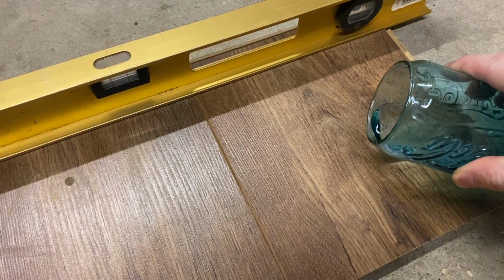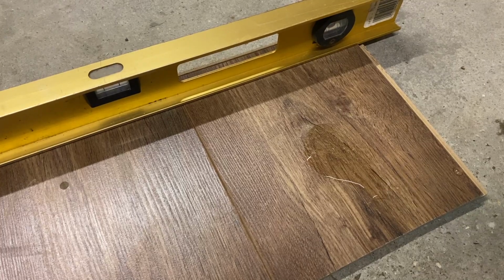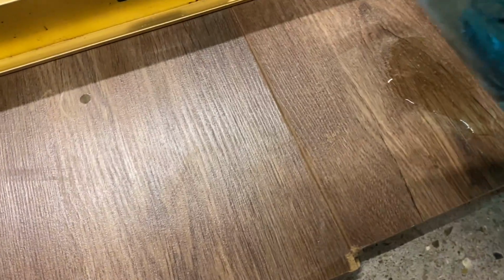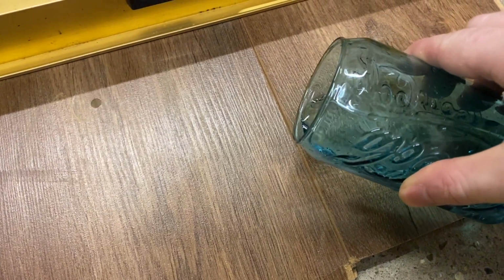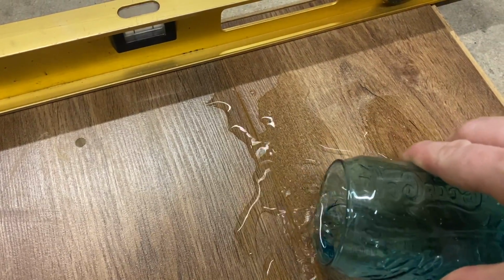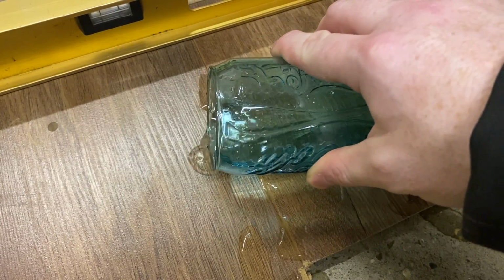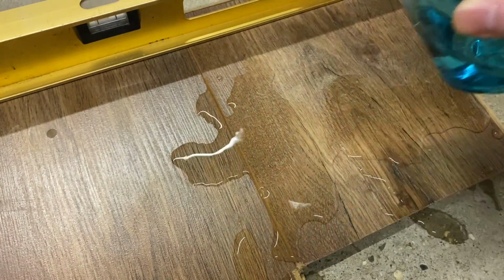And yes, you might well be thinking, and you are completely correct, obviously, if you spill water on the central part of the board, there isn't a problem. The water doesn't ingress into the board through the top of the board. It's at the edges. So I'm also going to pour a load of water down the join in this laminate flooring. After a little bit of hassle, realising that my test rig isn't actually level and all the water runs off, when I eventually get it to stay in the crack, we'll leave it for hours and see what happens.